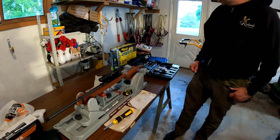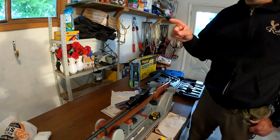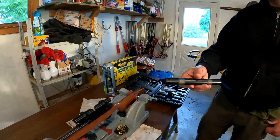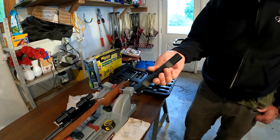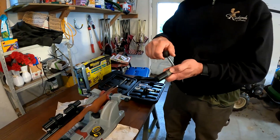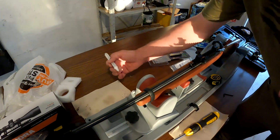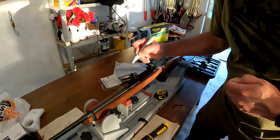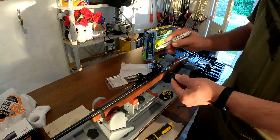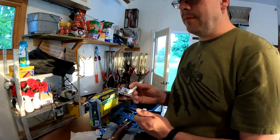We're back — actually several days later. The Loctite has had plenty of time to dry. The next step is to take the ring caps off and put in the lapping bar — a one-inch piece of round stock machined down with a handle. You put lapping compound on it and final-true the rings. I'm putting a mark on each ring cap and the corresponding bottom so I can put them back together the same way they came apart, since once these are lapped they'll all be matching.